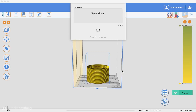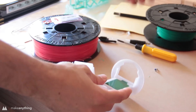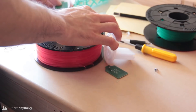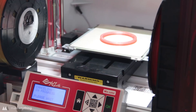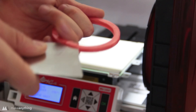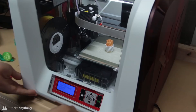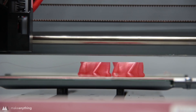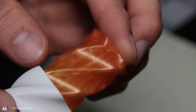The other big limitation is the spools. They have an NFC chip inside that communicates with the printer, telling it what color you're using and how much filament is left — but most of all it prevents you from using any third-party filament. After swapping out my green filament for red, I got a filament jam, but the printer actually detects the jam and stops the print automatically — which in this case was good because the springo was sticking together anyway. After that I tried a fidget twister and had the same problem — another filament jam, then one more at nearly the same spot. I just changed the file to use yellow blending to red instead, and that time I got a really cool fidget twister with a nice gradient.